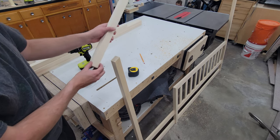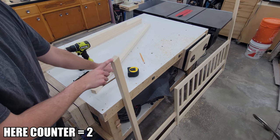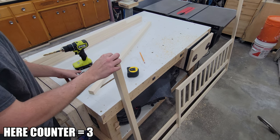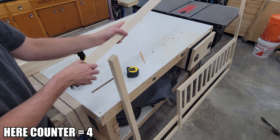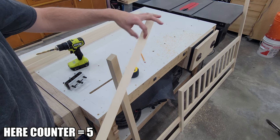We can go ahead and work on mounting these roof pieces here, which we're going to do again with some 3/8 inch dowels in the corners here. So I'll use my jig to center it somewhere over here so it doesn't blow out the other side. We'll put our center finding piece on, press it in here, drill the corresponding hole in this side, and then it's going to be onto the fun part where we actually have to crisscross the middle section here, and we'll do a half lap joint on the table saw.